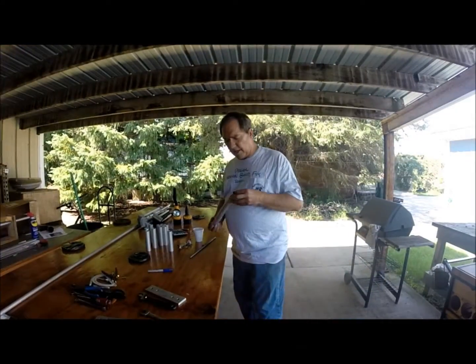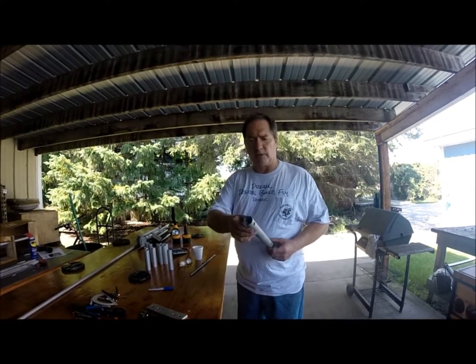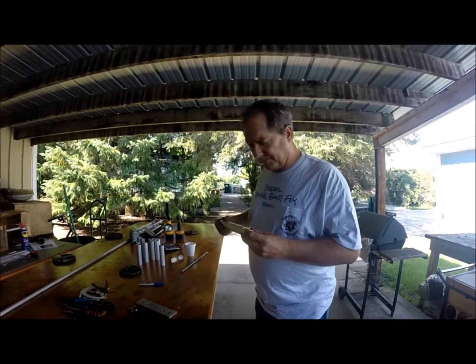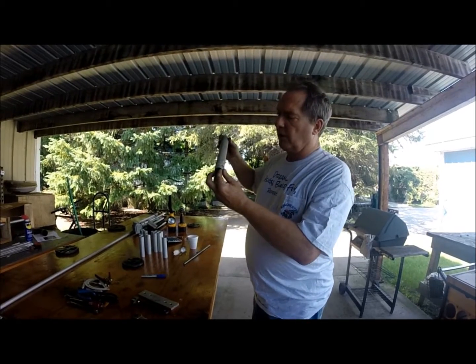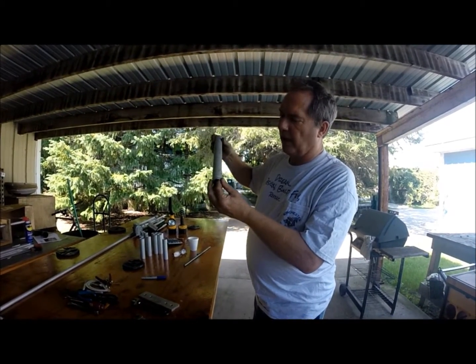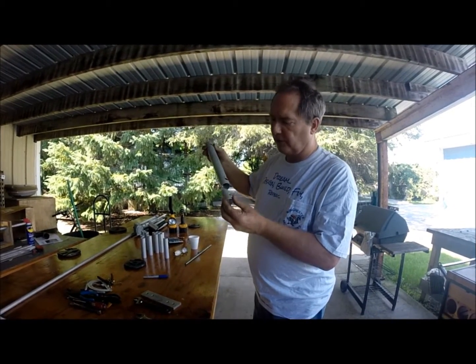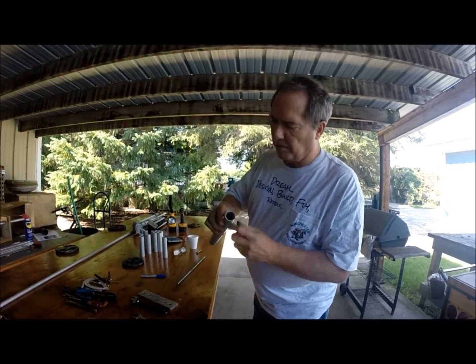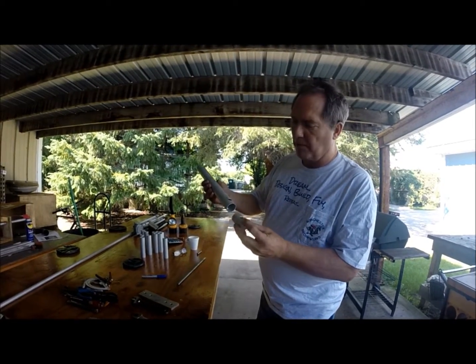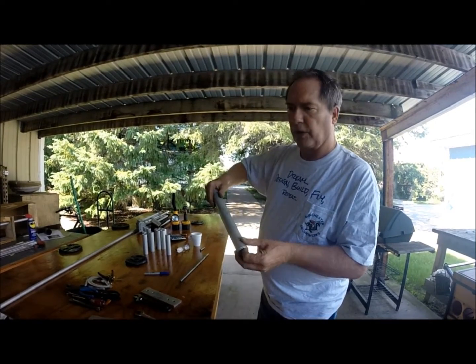Here we are at the Skunk Works again in association with Stolper Aerospace. We decided to design this little test unit. There's been some difference of opinion as to whether the doubler actually needs to be glued in and whether gluing it adds any strength. So our test: we've got a tube that we can fit half-inch rods through top and bottom. There's been a doubler glued in on the top, and on the bottom we're just going to slide the doubler in and put the tube through it. Then we're going to clamp it in a vise and destructively test it to see what fails first.